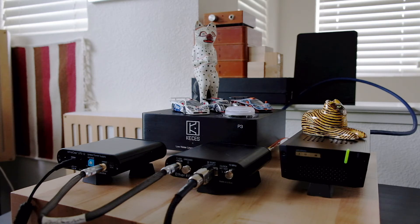The entire point of the network bridge is to make a network connection from your music server, which should be as far away as possible from your DAC. In my case, it's about 40 feet away in another room, to provide isolation from being connected directly via USB to the DAC, which is a bad idea. USB conveys all sorts of nasty noise components into DACs, so a network bridge eliminates those and lets you get the noisy computer or music server as far away from the DAC as possible, so your DAC and speaker wires aren't picking up noise from the computer in your main audio rack.